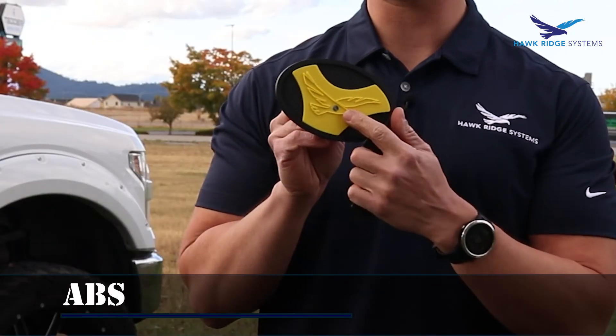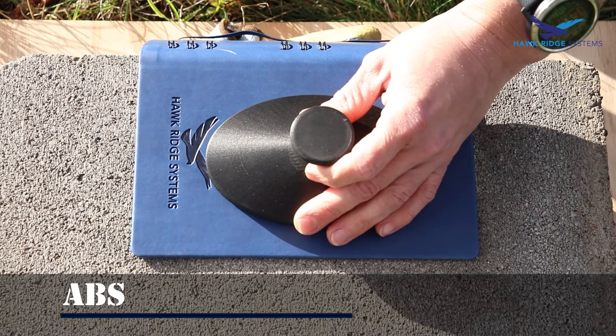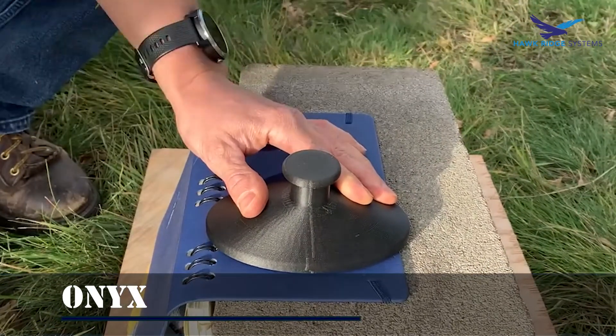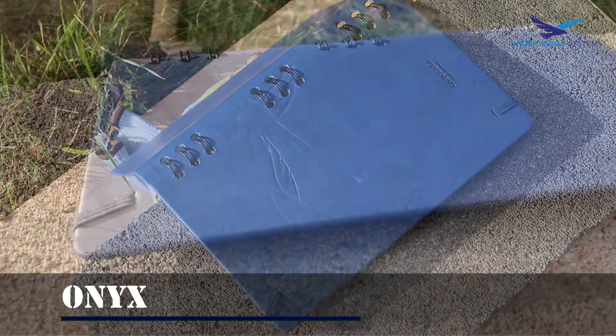With those logo designs I can swap it out. The ABS is a really good proof of concept — I can get a pretty inexpensive print quickly and just sort of test it out, make sure everything fits. That worked to my advantage here because I did find that I undersized the clearance hole for the screw just a little bit, so I did end up printing it again — little consequence there, pretty cheap part. Then we started printing with the Onyx material, and I was actually really impressed how this one did in the non-heated leather stamp scenario. We were able to just screw it on there, take a couple whacks at it, and it did in fact make a pretty good emboss in the leather — overall I was pleased with the results.